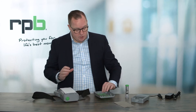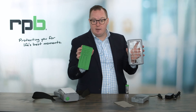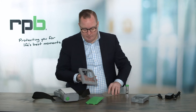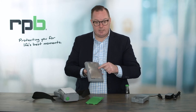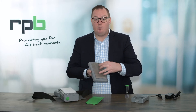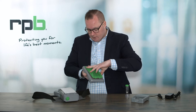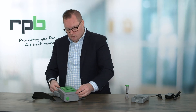With that now in position, we're now ready to install our spark arrester. We're going to take our main filter door and there are two clips that need to be pressed down to allow the spark arrester cover to come away from our filter door. With that now separated, we can then get our spark arrester and locate it between the two locators on the filter door itself. That spark arrester will only go on one way up. You can then reattach the spark arrester cover and ensure that it's clipped into position. We're now ready to install our filter door to the PX5.